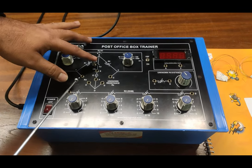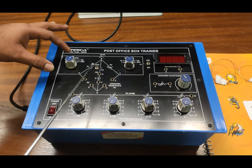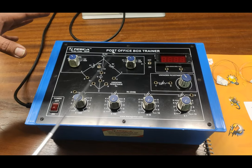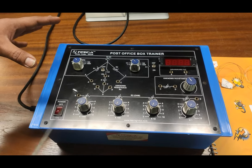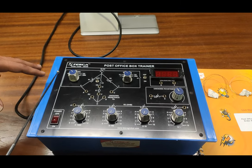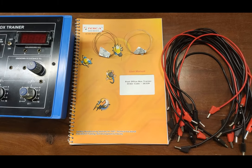These are the on/off switches to turn the galvanometer on and off and to provide the supply to the A and C arms. These are the R1 and R2 decade dials by which we can select any value for the different arms. In R1 and R2 we have four different values: 1 ohm, 10 ohm, 100 ohm, and 1000 ohm, providing four different ratios.